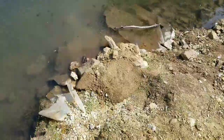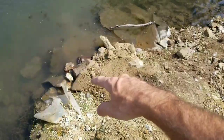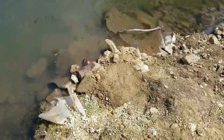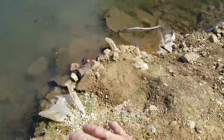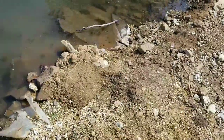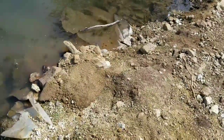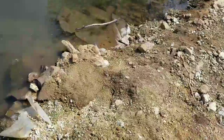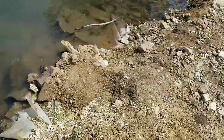I put several buckets of dirt in and placed all the big rocks in front of and around the culvert so that sharp metal is nowhere close. Eventually, once I can get sand, I'll put crushed rock down first to make a solid base, then add sand on top — with those couple of layers, that culvert should never be messed with.